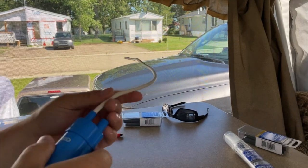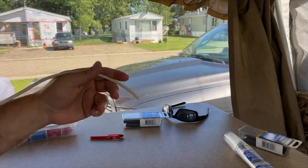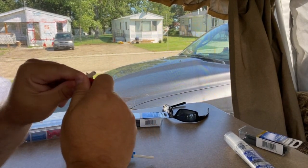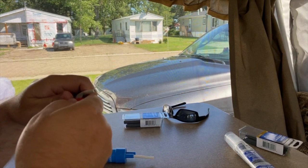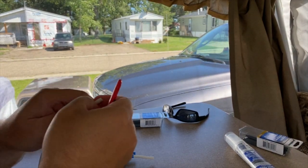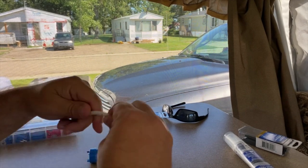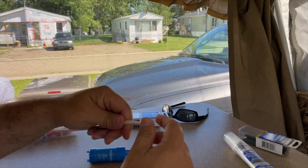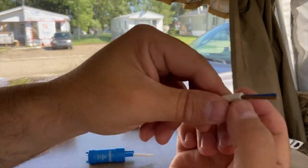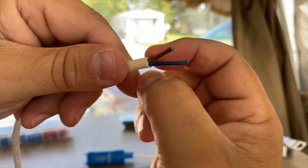The first thing I'm going to do is cut the wire from the old pump and then flip it so that I have access to the wires. Just be careful not to strip the wires inside or notch them, because that's going to probably short and cause problems. What you can do is cut it just enough so that when you bend it like this, it breaks and you can take it off - and you haven't notched your wires, so you don't see the copper.